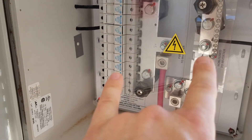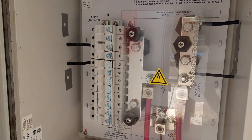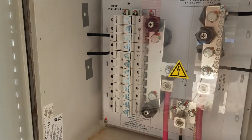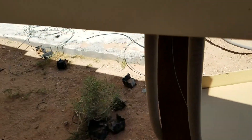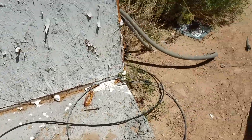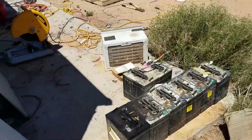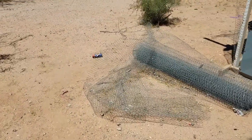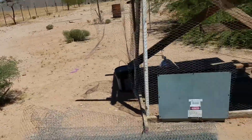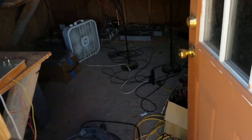I had just recently measured the voltage when it was charging the car and running the air conditioner, and it sagged the panel voltage down to about 405 volts. The nice thing about the inverter is that it just takes whatever power it needs — it pulls the panel voltage down from 500 down to whatever until it's using the power it needs. The downside is that if you overload it, it's like hitting a brick wall and it'll shut it down, but it's not a big deal — you just don't overload it.